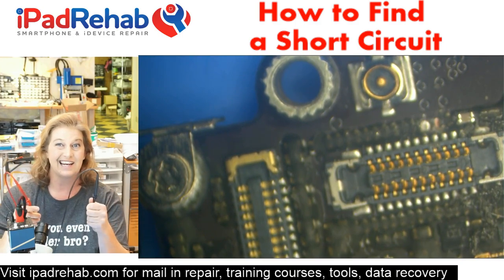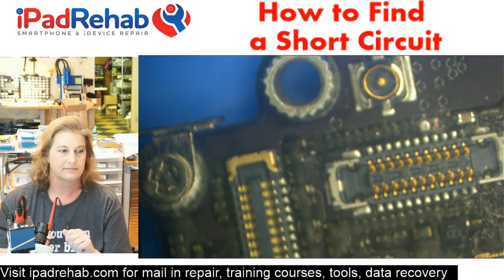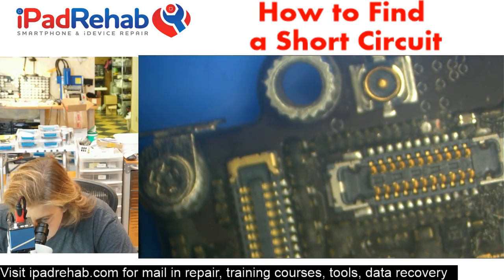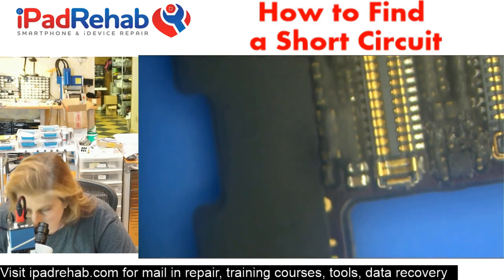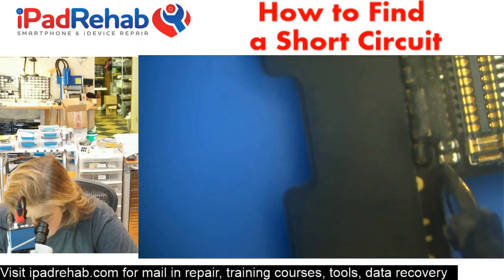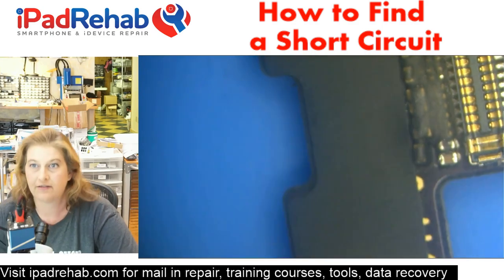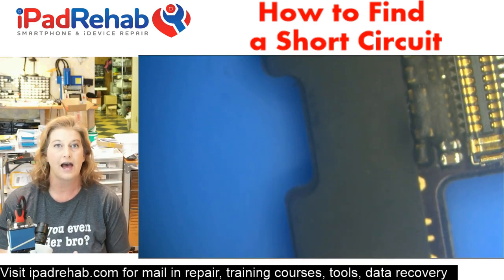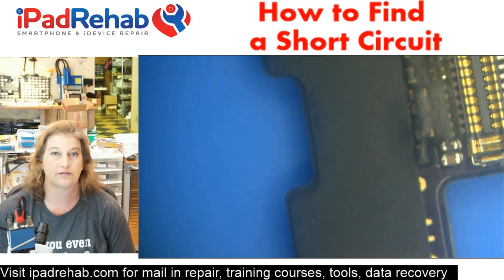Now that we kicked off that cap, let's see whether or not we still have a short. Let's go back and test it on our buddy over here, whoever he is, 4215. All right, one side ground, other side, diode mode reading, 0.455. 0.455, ha-ha, we found it. There we go, we found a short circuit.